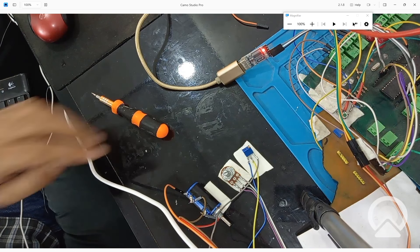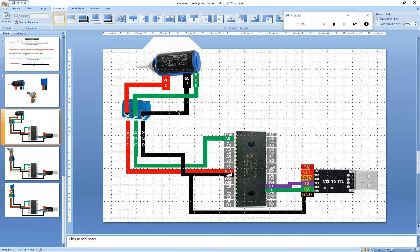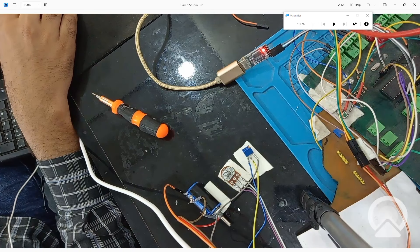As you can see, we have three potentiometers for testing in this device. We have a potentiometer and connect VCC to this terminal, VCC; ADC to the ADC; ground to the ground. Similarly for the second potentiometer we do the same, and for the third one as well. The adjustable pin of your potentiometer, as shown in the datasheet, goes to the ADC pin. The other two can be VCC and ground — you can shuffle those two as well.